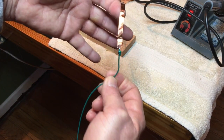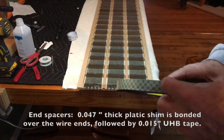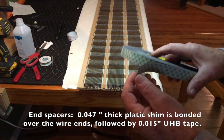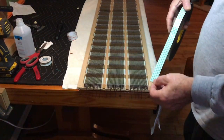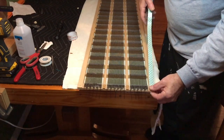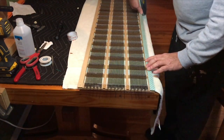So this is my connection between the wire and the copper foil charge ring. I've got some 1/16th-thick 3M polyurethane double-sided mounting tape, and this is going to serve as the spacer that stands the stator a 16th of an inch away from the diaphragm. I'm going to go around the edge and install the spacers.